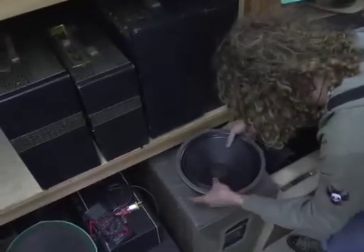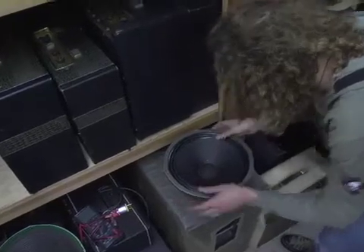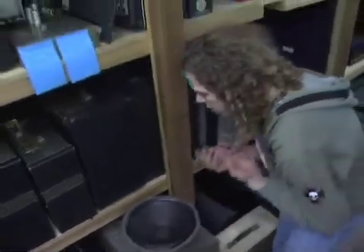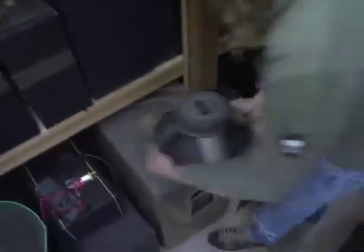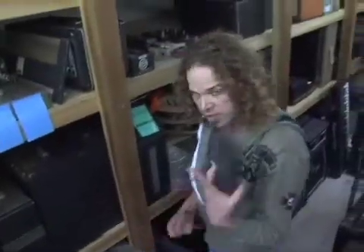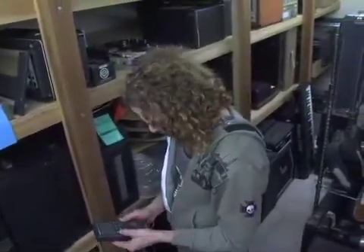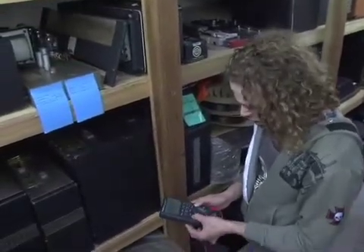This cone is cool — it's ready to go. The other thing I want to show you today is measuring the impedance of a speaker. This speaker should be a 16 ohm speaker and what I'm going to do is use my digital multimeter. I'm going to turn it to impedance.